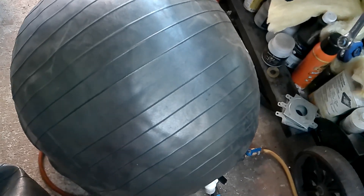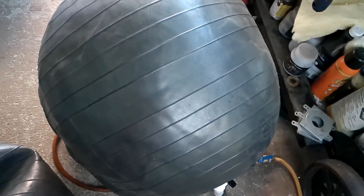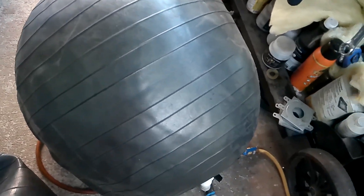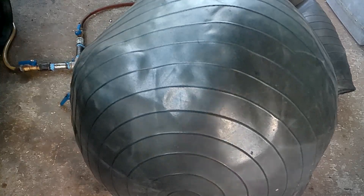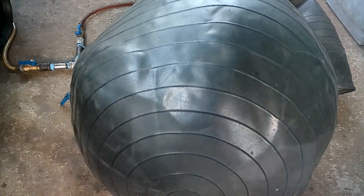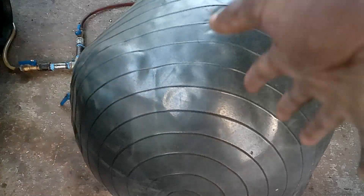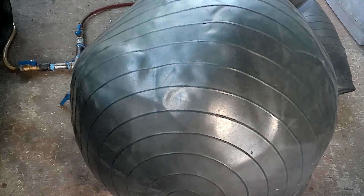Filling up the whole volume with styrofoam maybe didn't give us that much carbon, but it certainly gave us a lot of gas — I got about four yoga balls full. That's actually a good amount. A little sneak peek spoiler alert: I just cannot wait to distill all of this oil we've been collecting. The goal is to collect over a gallon of pyrolysis oil and distill it out, and say — okay, with a gallon of pyrolysis oil, we get this much diesel, this much gasoline, this much jet fuel. So now we can know, for every run, about how much of each we're getting.